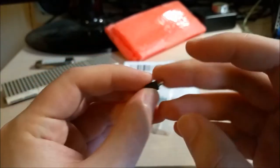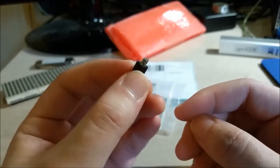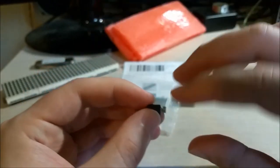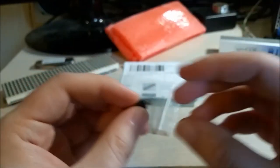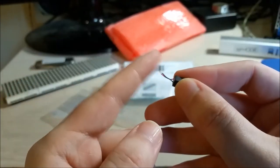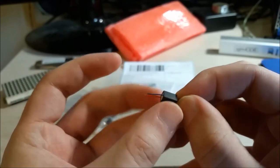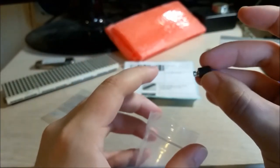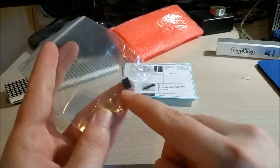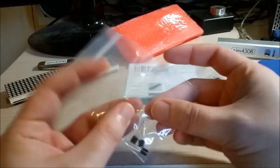These motors require some kind of mechanical actuator. If I get a whole bunch of these motors, all I'd have to do is fix an armature to them with a disc, mount them in a frame, and 3D print the discs in two colors — black and white — so they can cycle between one side or the other. All I need then is an H-bridge, or a half bridge with a floating ground, to drive the motors so they can flip one way or the other. I'm going to make a little tiny prototype first to test the concept. For a seven-segment clock with four digits, I'd need 28 of these motors, so it's a bit of an investment. We'll see how that goes — I'll do a future video on it once I get it working.